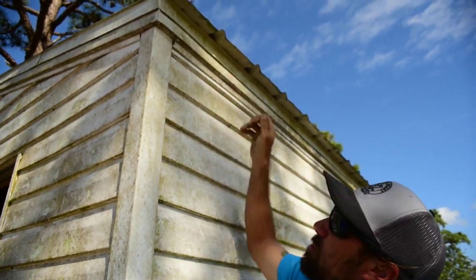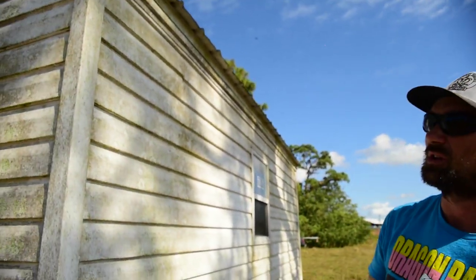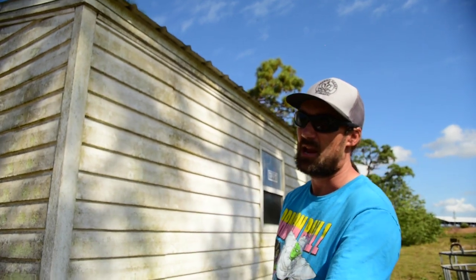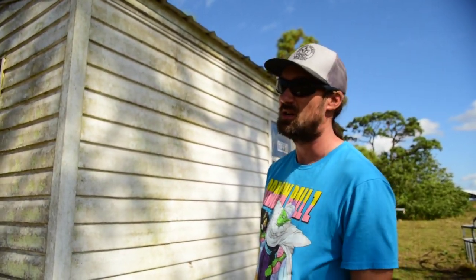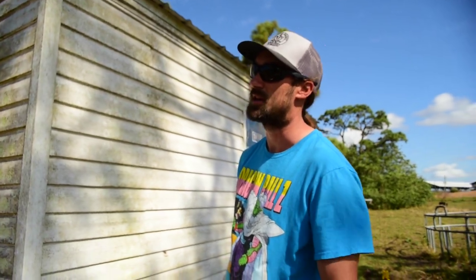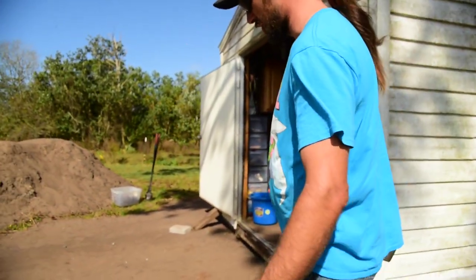This shed's got pretty tight drip edge - they wrapped it in one piece so it makes it a little tight. They didn't put corners on there so we might have to do a little notching in the metal. If yours has an overhang, that's great. Some places they add a one-by-two behind the drip edge to keep the water from kicking back on the fascia - that helps save your fascia wood. This is all vinyl and aluminum so we had no need for that extra kick-out. That's how you would install your straps.